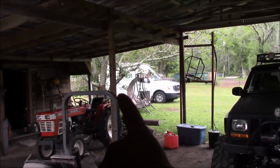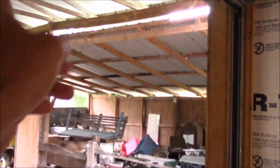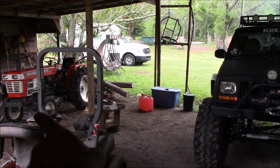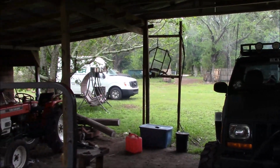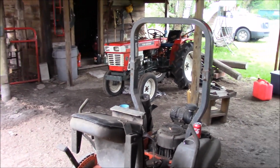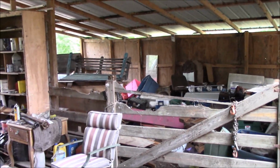And then we'll come in between each one of these poles, go up there, put a 2x8, same thing over here, 2x8, and then kind of close it in, but leave it open to this side here. And I'm going to put rock on that side over there, because what drove me nuts on the concrete before was plasma cutting and grinding and stuff. It gets everywhere. So that side over there we may leave rock. Just put some rock like in the driveway out there. It's millings or slag. Put the slag down, and we'll just add to the slag, grinding and welding and all that stuff over there. That's the plan. I don't know what's going to go on over there yet. I think that's going to be storage for lawnmowers and tractors and things.